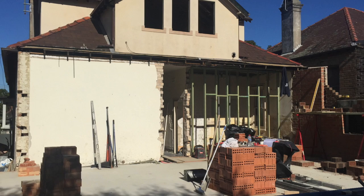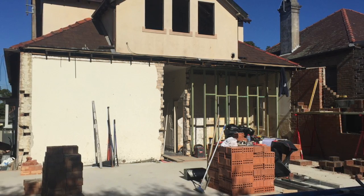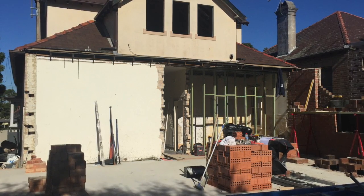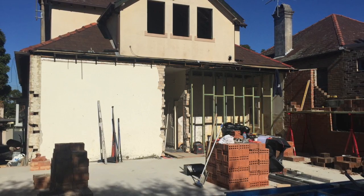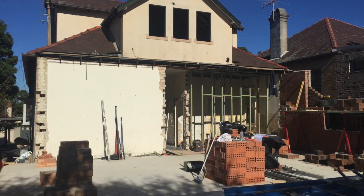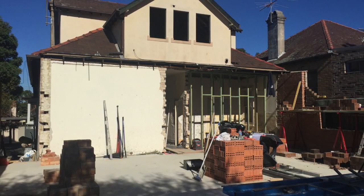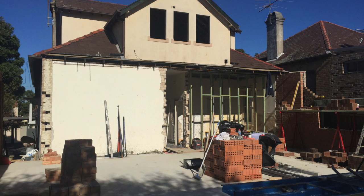Alright, so with all those stud walls then, you're doing a steel... Yeah, it's all steel PFCs through there, 300 through the middle to take the joists. The joists will cantilever over the brickwork on the eastern side, and they've got a steel PFC the whole way around as a feature. It's a painted feature from the architect's design, so it'll look very smart.